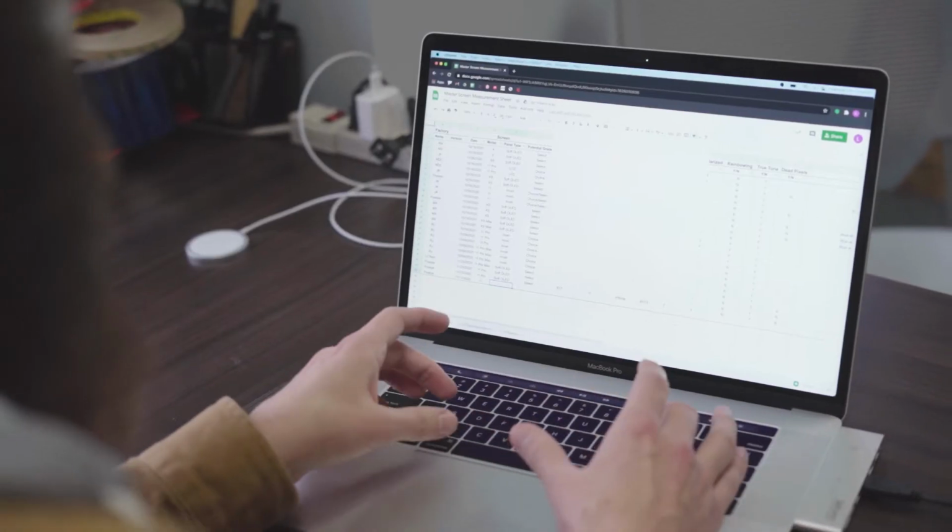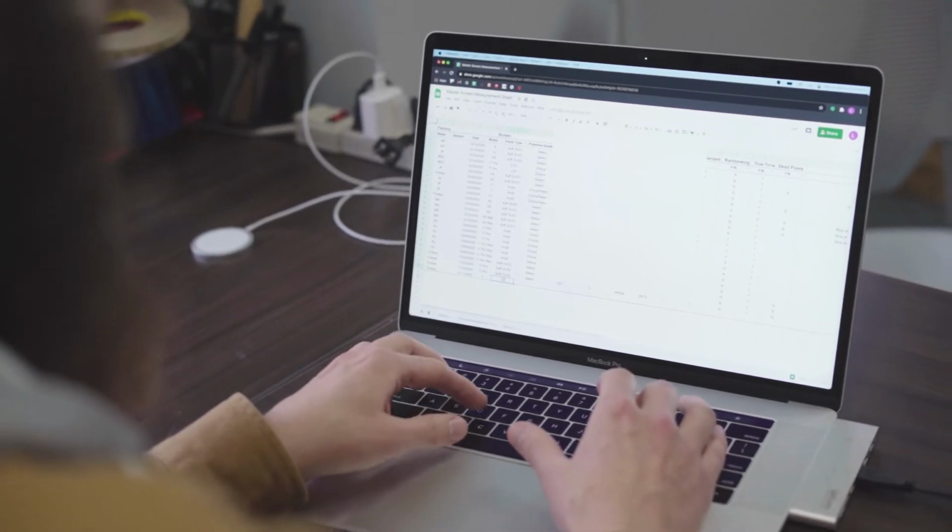We look at the contrast of your display, the black level, the white level, and we need both tools to get us the whole range of numbers. So we'll often run the test once with one tool, and then run the test again with another tool, and use the numbers we know are going to be more accurate for each of those respective tools, and find what the display can do and how it performs.